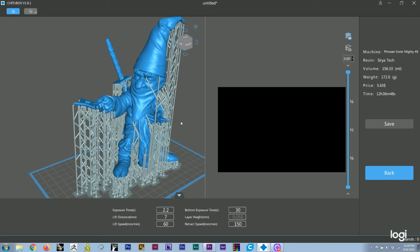You cut the cross section of the model so that you're not going to put too much suction on that film as it pulls away, but mostly you're just tilting the details you want to favor upwards or downwards, so that you don't end up with supports all over the face. But generally they're going to end up on the bottom side, back side of your model.